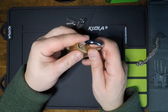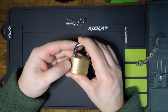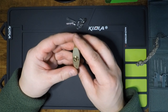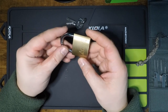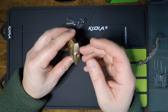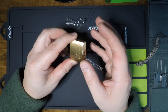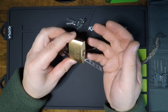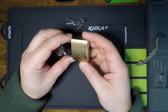And there we have an open. Overall, pretty impressive core on these ACE padlocks — definitely great locks to pick up if you want to practice with security pins, spools, and serrated pins. We can't gut this, but based on how it behaved, my guess would be that pin 1 was a spool, 2 was serrated, 3 was a spool. Pin 4, when it clicked into place, there was only one click and it didn't travel far — so it could be serrated, or it might not be coming into play because the pin stack is so long. And then pin 5, following the pattern, would be a spool, though it behaved perhaps more like a serrated pin — hard to say, that could just be the bitting and positioning.